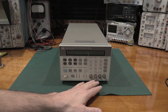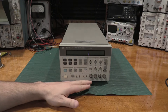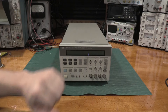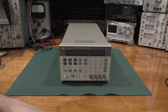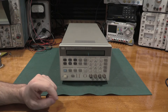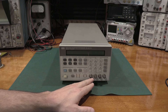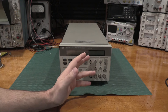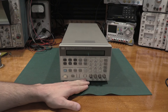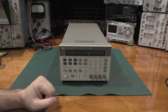One of the options adds four synthesizers to this unit, and they can modulate channel one. So I can set three different styles of modulation, sum those all up, and then modulate channel one which has a carrier coming out of it from DC to 600 kHz — incredibly useful. Also rare for function generators is the ability to float the outputs: output ground reference, shield ground reference, or fully float it depending on modulation setup. Not many function generators do that.